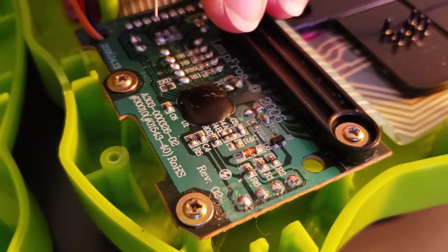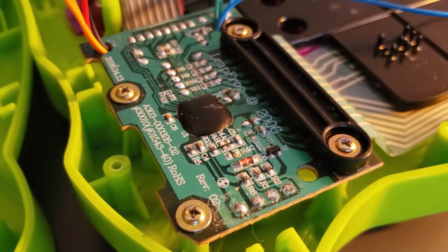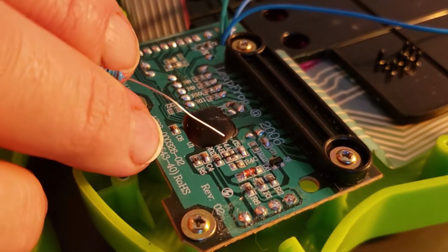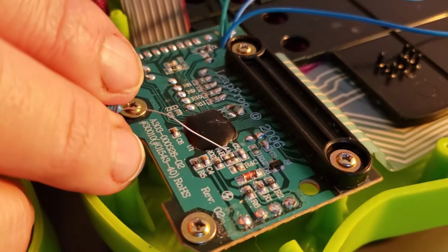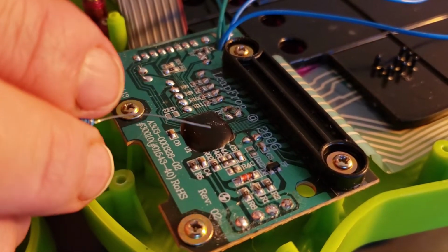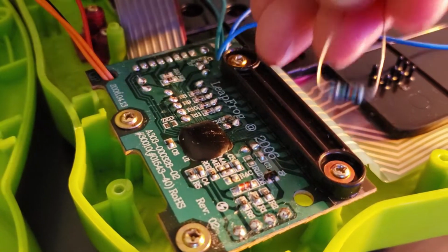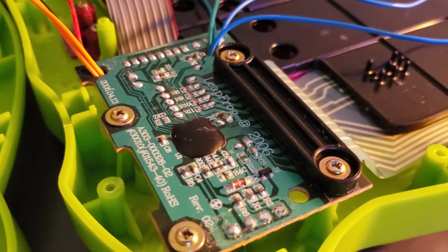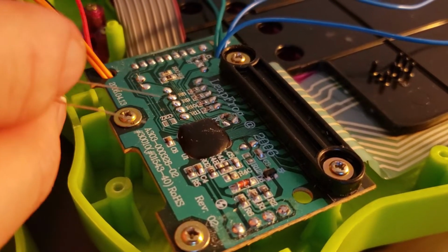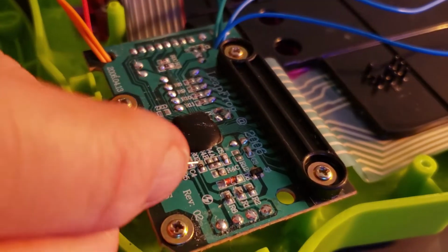So now that we have the area kind of isolated and we know where we're getting the bend at, but I don't actually know which resistor is the culprit in giving us that bend. So it's around this area. It's one of these three, but I'm not really sure which one it is. And what I'm going to do is I'm going to take a resistor. So I'm not bare wiring this. I'm just going to take this resistor so we're running less of a chance to actually fry the instrument, and I'm just going to touch on each side and figure out which one is actually doing this.